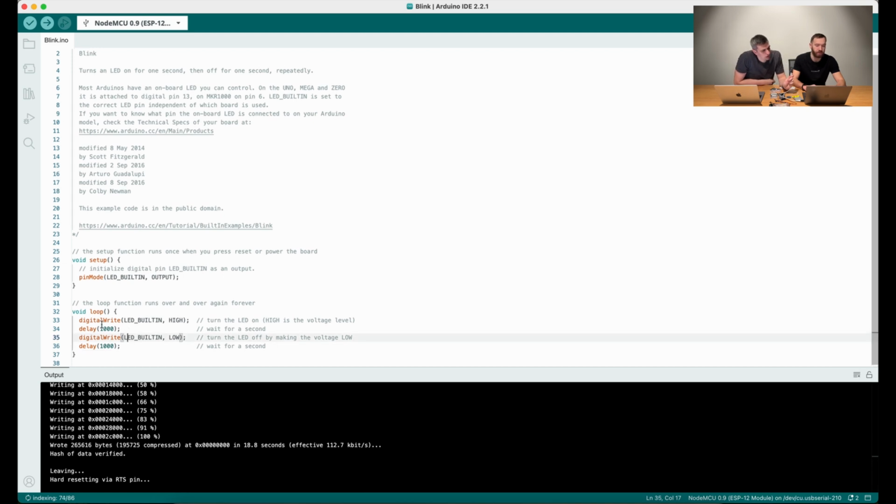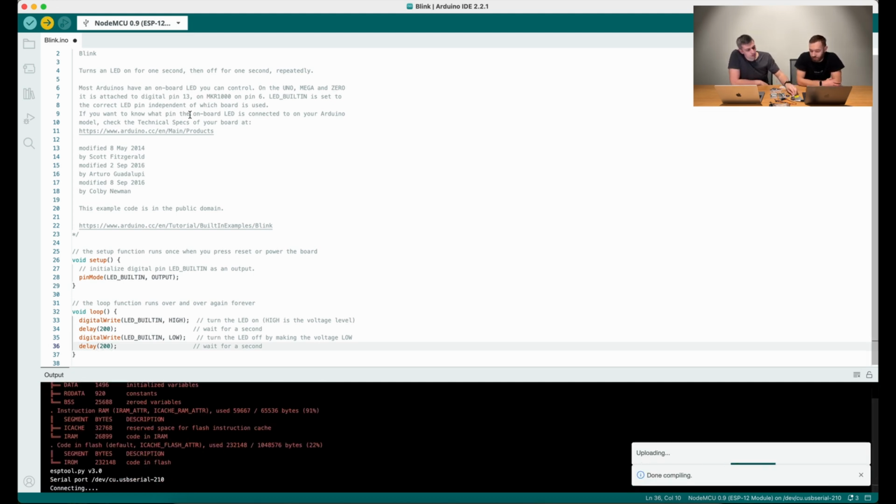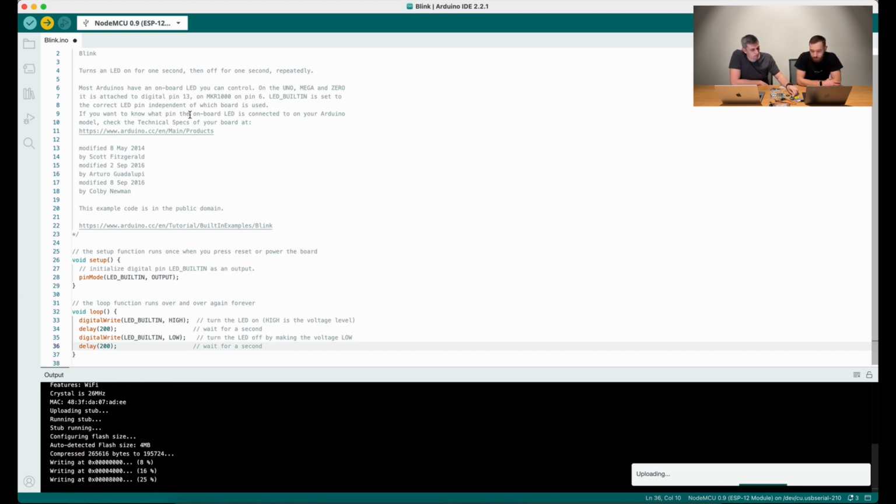So now we can change the delay. Currently it's 1 second. We can set, I don't know, 50 milliseconds, or something even smaller. Let's say 200 milliseconds, and let's try again. Now we're uploading new code, and we will see it start blinking more rapidly.